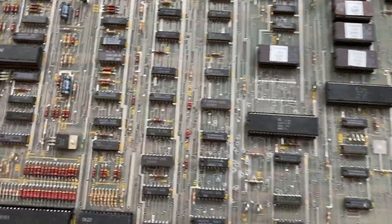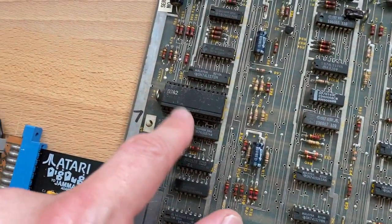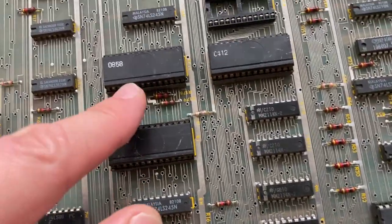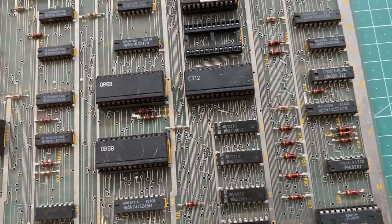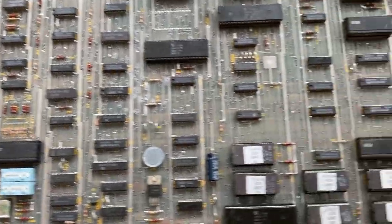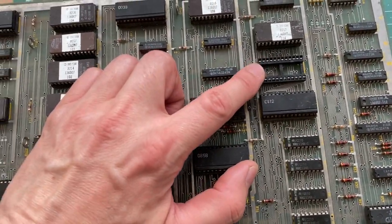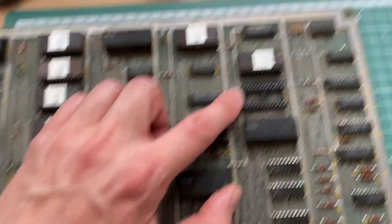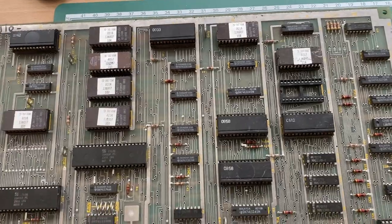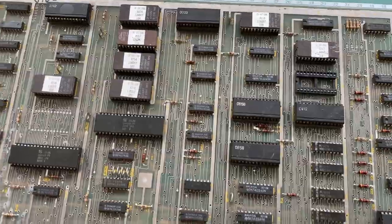The board does have some custom ICs, unfortunately, and the legs of those custom ICs tend to corrode very much. We will have to figure out how to deal with that. Before I bought it, I already looked at what kind of chip is missing. I at first thought it could be an EEPROM, but what is actually missing is a RAM chip - and luckily not a custom chip - so the RAM chip can of course be replaced.